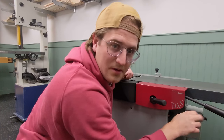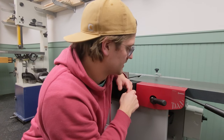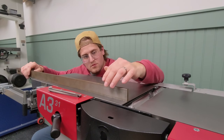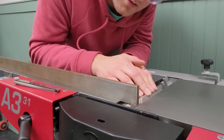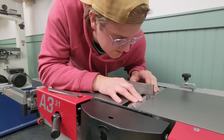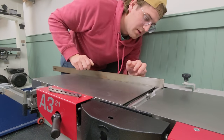It's time for the scary part — actually calibrating. That's beautiful. I wish you could see my old 6-inch from four or five years ago; it was a constant battle trying to clean that thing up. As far as I remember, step one is getting the outfeed set to the cutter head — need to get it just touching. Can you hear that? Pretty sure that is perfect. Seems a bit heavier — you can really hear that one. But I think we're good. I'm liking this so far.